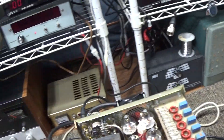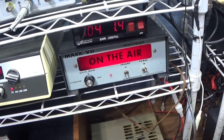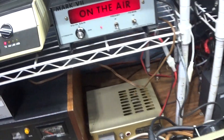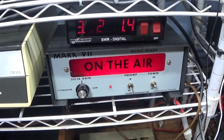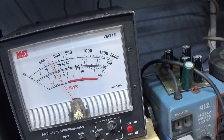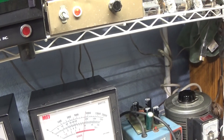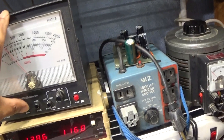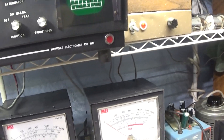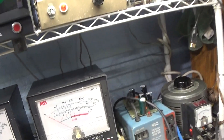We're running the Raider as a driver for it, so the Raider is on standby. With everything in line - the radio, the preamp left in line, the digital watt meter, then the Raider, then the LA-1000A, then going to a dummy load - there's a lot of junk in line. That's why I'm getting 1.5 SWR; if I took some of it out it would be flat. The radio is doing about two and a half watts with all that junk in line, showing about 10 peak on peak scale.